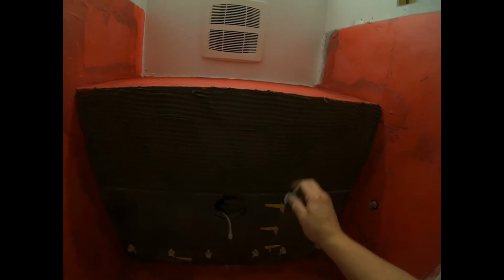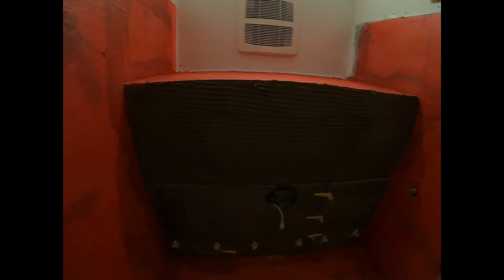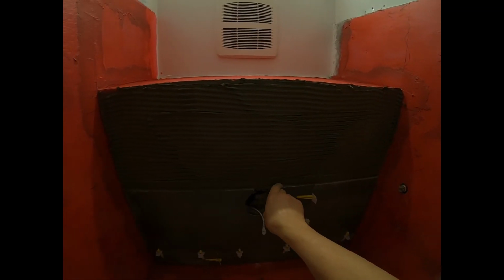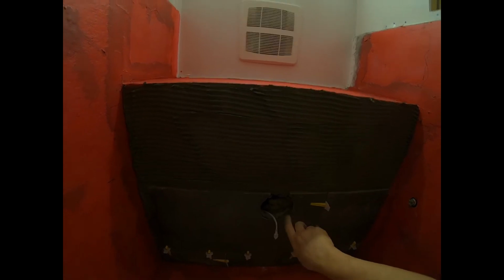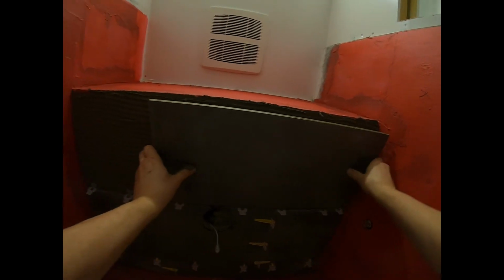Okay, so I've got the mortar on here on this other section. I've got it troweled and I've cleaned out the space next to the other tile. Get a little more out of there. Like that. And we've got our tile spacers we're going to put in there. From there it goes. Like that.